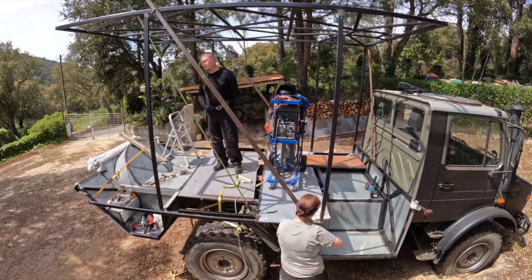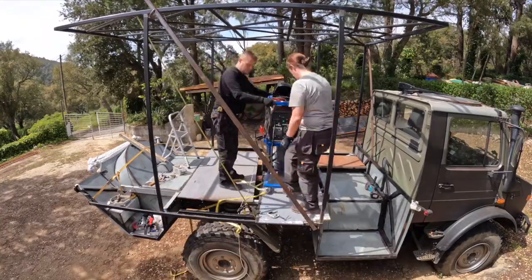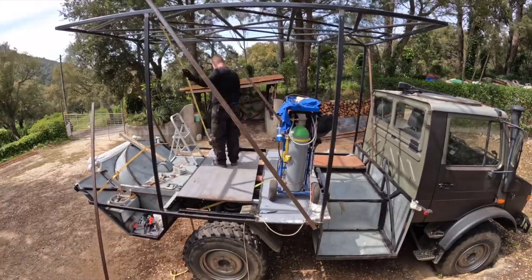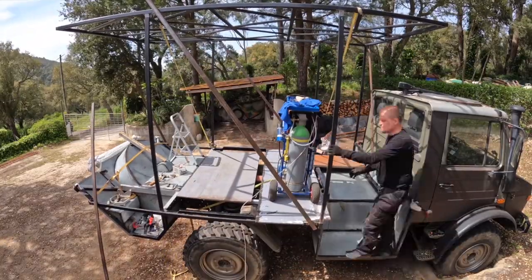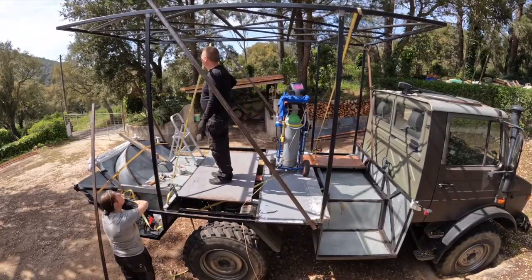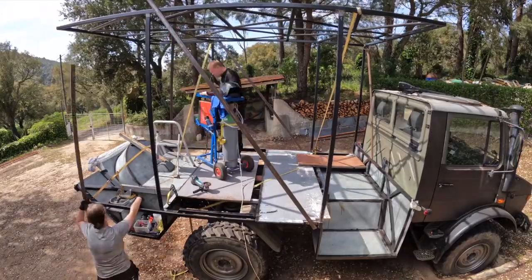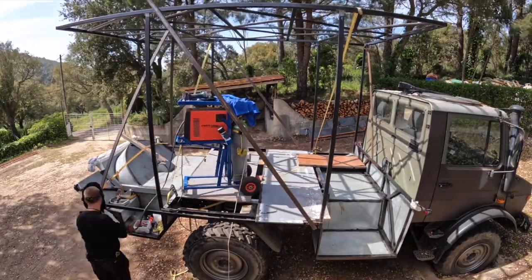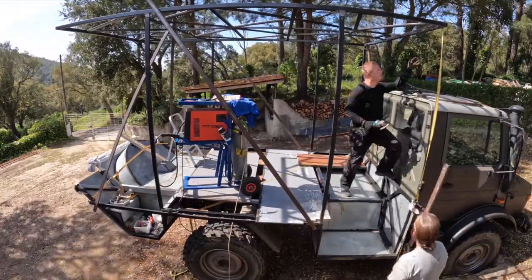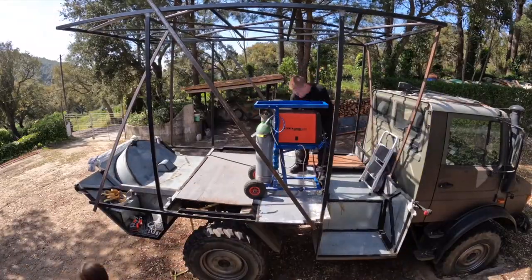We have six bracing sticks. Two on the sides, stabilizing in the front rear direction. Then there's two on the front, which stabilize the roof side to side, but also hold it flat and level due to the passenger side upright missing. The last two braces brace the rear side to side, but because they're attached at a compound angle, they also brace the roof front to back. To force the roof into what we believe is the correct spot, we use ratchet straps. And just like that, it's done!